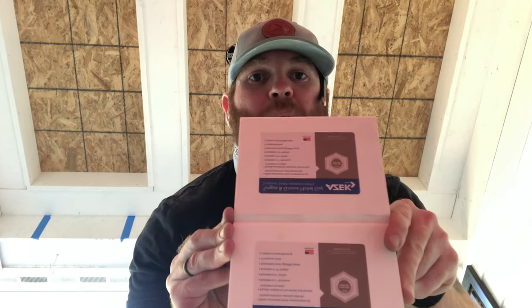Technically that is a coffered ceiling, but what we're going to do is take our Azek tongue and groove nickel gap profile, flip it around and use the WP4 profile. So time to measure and install. Measuring each step of the way is ideal — if any board wavers, it could throw off the entire look of the porch ceiling.